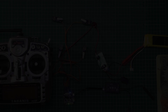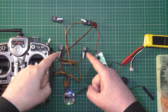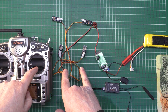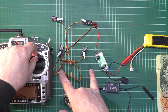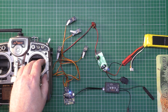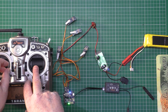I've figured out how to do a custom mixer for a V-tail. The two elevator-come-rudder servos and the two aileron servos are set up so that when I pull back on the stick the two tail ones both go inwards, and pushing forward they both go outwards. If I bank right, one goes one way and one goes the other. With rudder input they both go the same way, which is how they should.